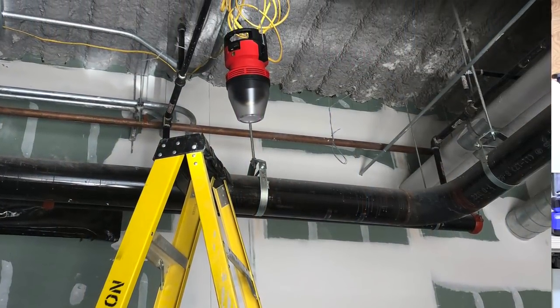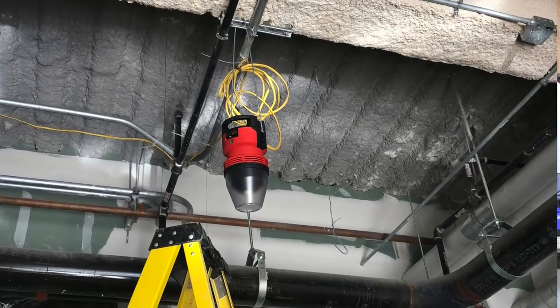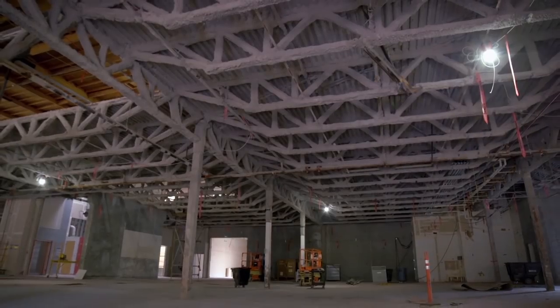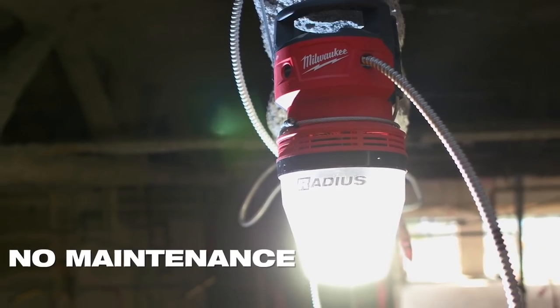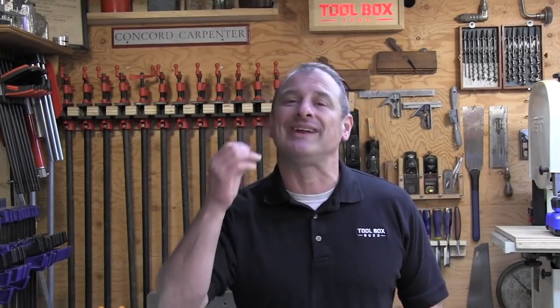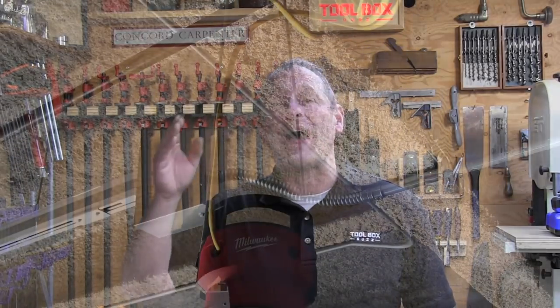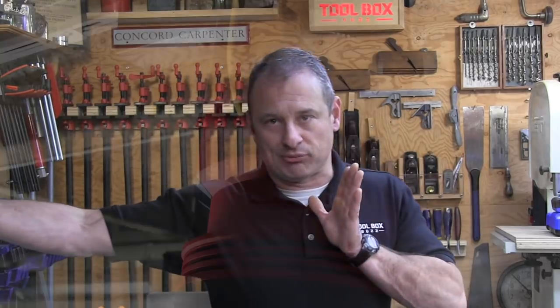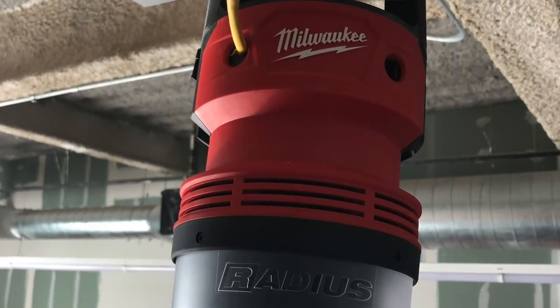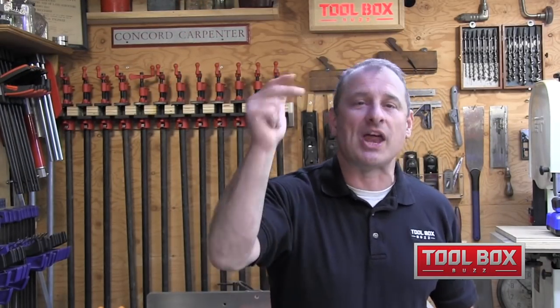In summary, the LED lighting experiment with the 2155 fixtures was an overwhelming success. We installed the fixtures in very short time, installation and operation are safer, the unit is more robust, and it virtually eliminates on-site maintenance — no bumped or changed bulbs, and the light quality is outstanding. Compared to high-bay temporary lighting installations, the Milwaukee 2155 is at par or better over the life of the project — not initial purchase, but as a long-term investment. Easy setup, instant light, no ramp-up time, and no maintenance.